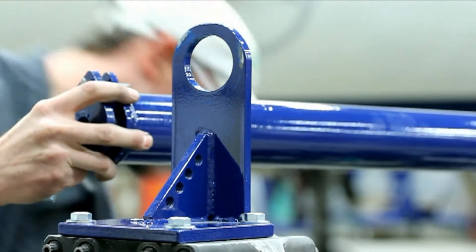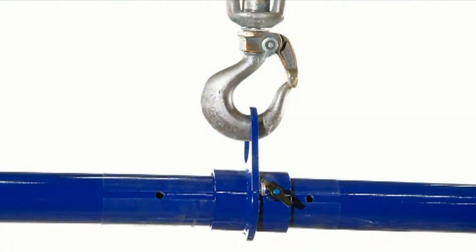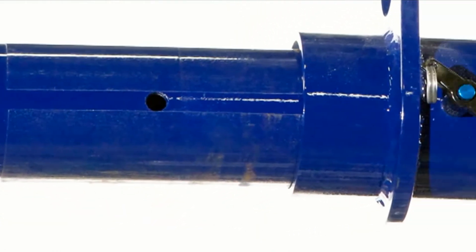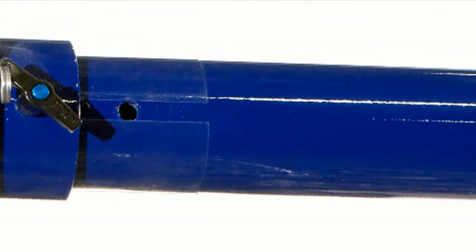The adapter has several holes incorporated for positioning to the center lifting ring. The purpose of these holes is to obtain the center of gravity for different engine configurations, for example, whether the engine is fully QEC'd or not.